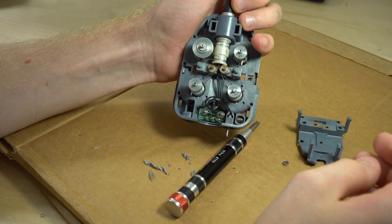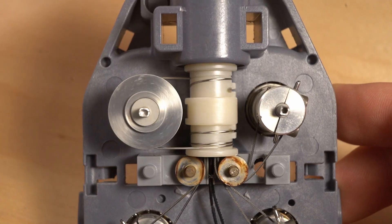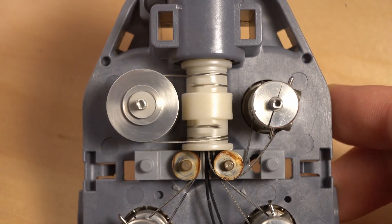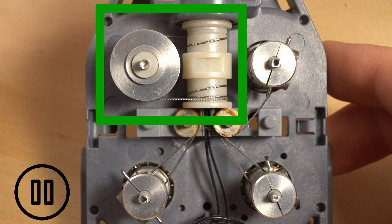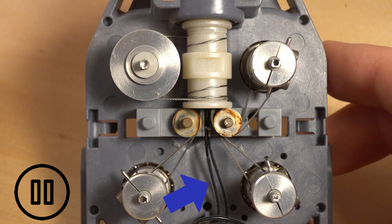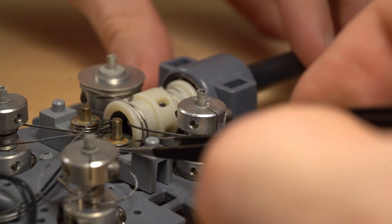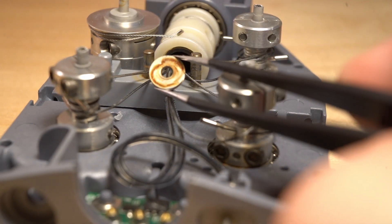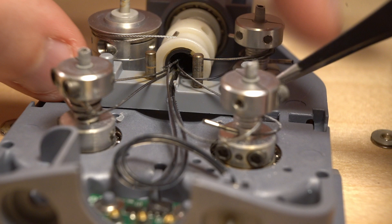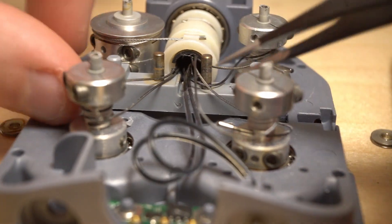Now we can see inside the device. This is the large pulley rolling and unrolling the twist axis. In this overhead view you can see all the pulleys - cables enter into the shaft at one location, the three smaller pulleys go around guide pulleys to enter the shaft, while the larger pulley stays within this portion of the device. The cautery wires also enter here from the bottom. The guide pulleys are basically plain bearings - probably stainless steel - though quite rusted from the autoclaving process.